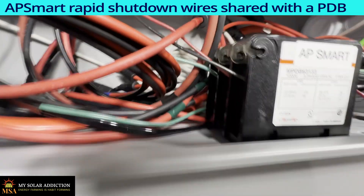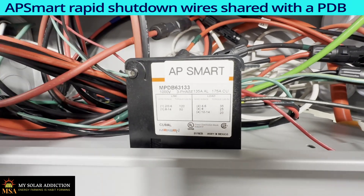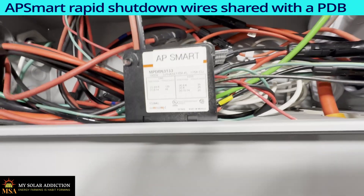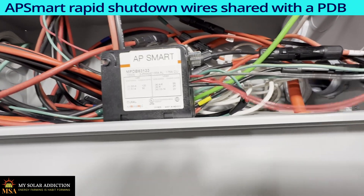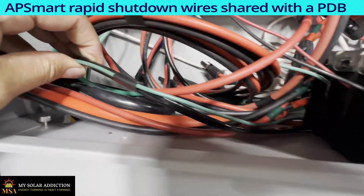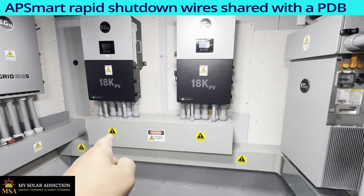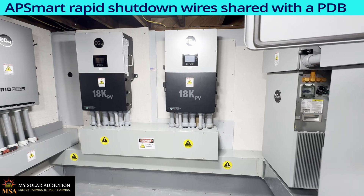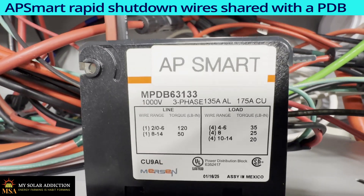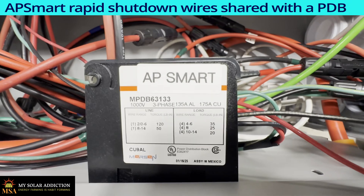As part of my new setup, I also used one of those power distribution blocks to share my AP Smart rapid shutdown that is on my patio array connected to my house. I have to have rapid shutdown, and here are the wires coming in from that rapid shutdown system. I've got it coming in on this side — they have little covers on them, which are pretty nice. Then on this side I have the wires coming back out: these go to the Solar Arc, and the other ones over here go down through here to the 18k PV master, which is the one on the left. You can use these little power distribution blocks for all kinds of stuff — I like them. And they're not that expensive on Zoro; that's where I bought them from. There'll be a link in the description below.